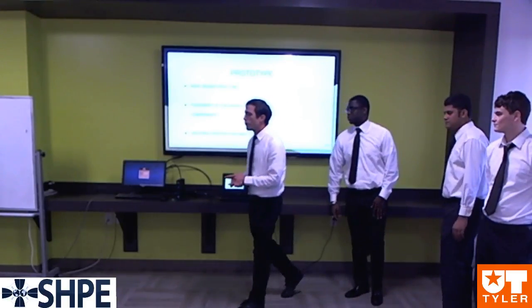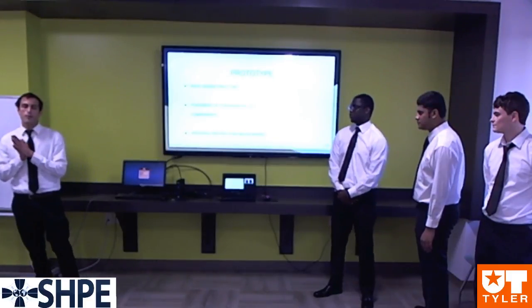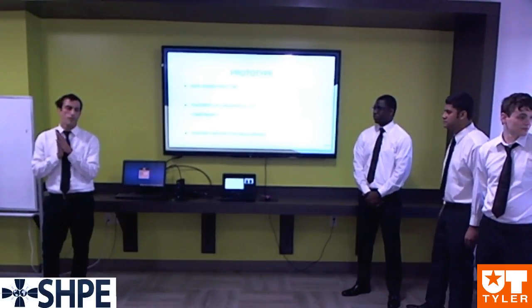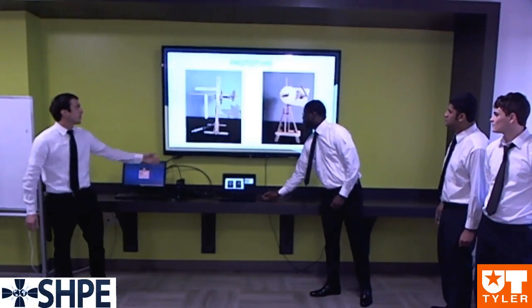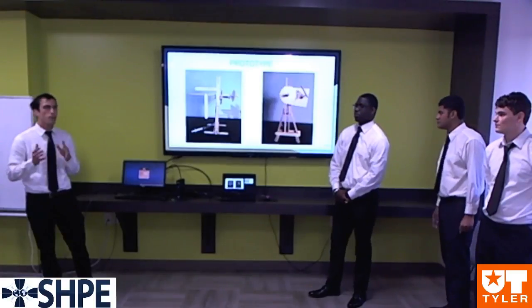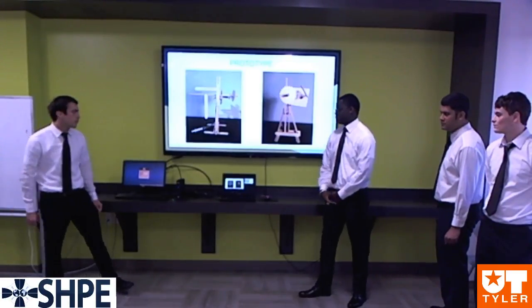Next, we started off by making a prototype so we could solidify some of our basic design components and concepts. It's made out of balsa wood and uses syringes in the form of the ram. Over here you can see the side and front view of our construction. What this prototype taught us is that we actually needed to widen our base to accommodate our moped possibly tipping during loading, forward and side to side.